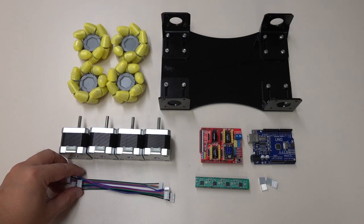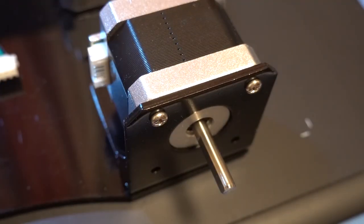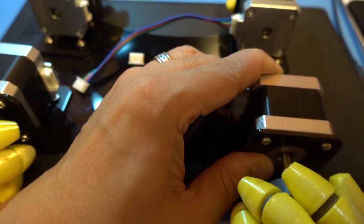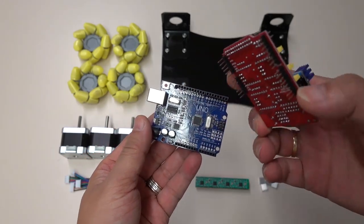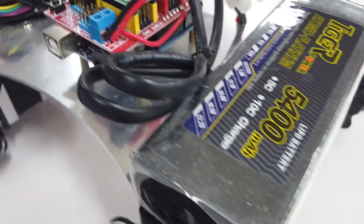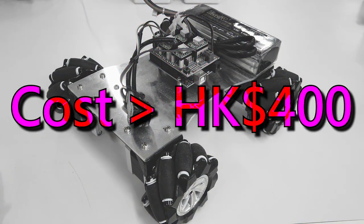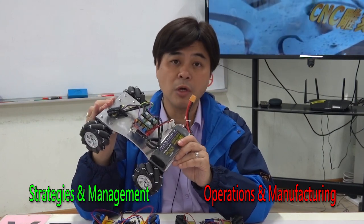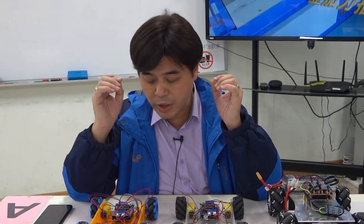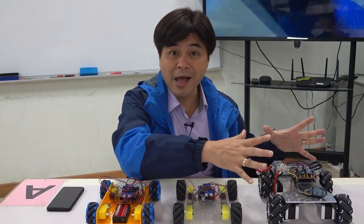This prototype used four sets of steppers and wheels. An L-shaped bracket is needed for each set of steppers, plus eight screws and four nuts. Every part costs money. There are also Arduino and CNC shielding, four A4988 drivers, plus a 12V 5400mAh battery. Excluding materials for the case and manpower, it costs more than $400 Hong Kong dollars. To teach these two areas, we cannot follow this prototype. So Carlos collected information to find parts and materials cheaper and more suitable for mass production.